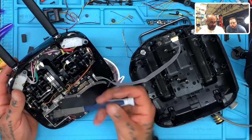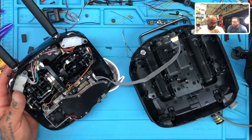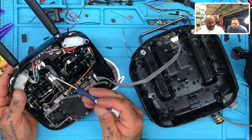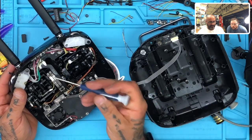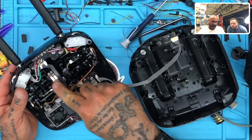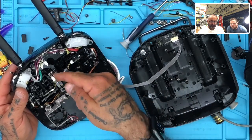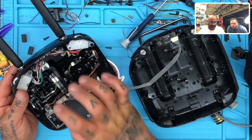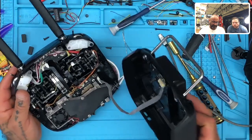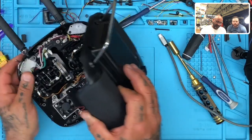Guys, just so you know, because I was checking this out myself right now, you do the right side, or basically the outside screw, for the tension, but the inside screw for that clicking, that notch feeling. So you'll hear the gears more on this side and feel them. And if you don't want that, but you still need tension so you can hold the stick in place, then tighten that side only. Okay, guys? So hopefully that helps. That's something that I learned today. And it works that way with both orientations, right?